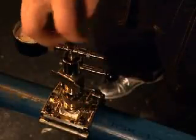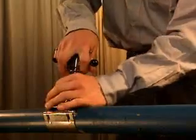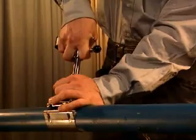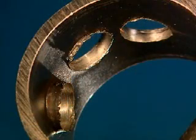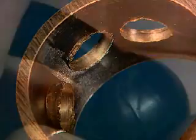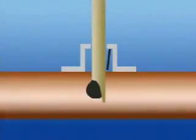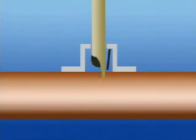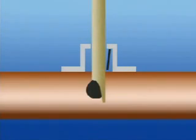When the work is done, deflate the balloon by unscrewing the blocking device plug. Release the locking shackle and pull the blocking device straight out of the adapter. Beware — do not pull out the stop ball and avoid turning the device. You don't want the burrs on the edge of the hole cutting the neck of the balloon. Immediately the balloon is clear of the non-return valve in the clamp, the valve will close and seal against leakage. Remember to withdraw the complete blocking device.